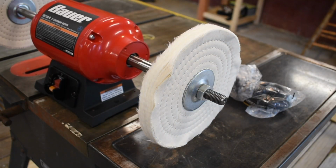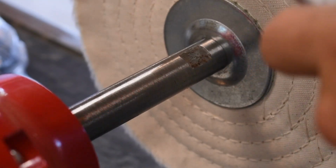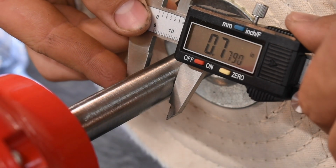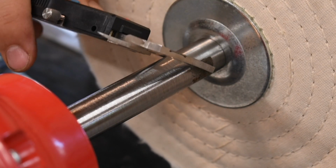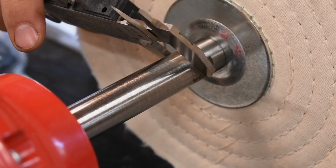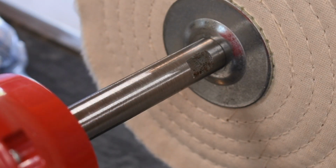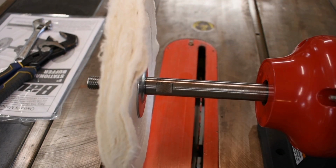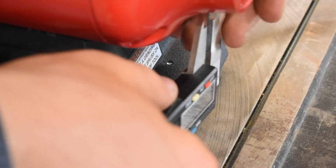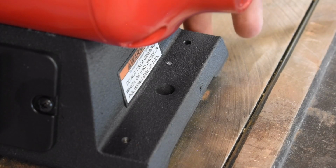We're gonna check some dimensions. 0.617, very nearly 5/8 of an inch. Check this one. Looks like a 3/4. 0.777. And the flats, 0.66. That's not even ordinary. 0.66. That's what? 400ths over 5/8. It may just be super rough grinding. It looks pretty rough. That's like 100th off, so could just be that. Check the hole size, just in case. So 0.4, so you can fit a 3/8 in there.